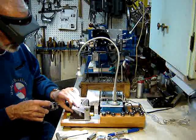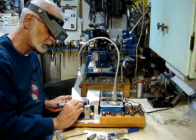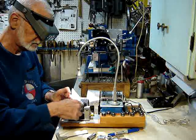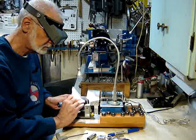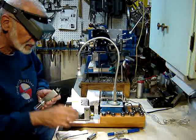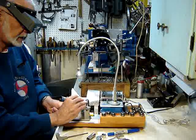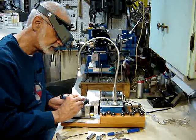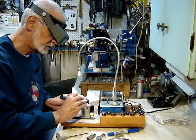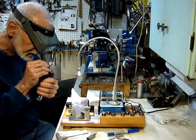Now all we do is push the triangle and let it drop to the primary facet angle. When we don't change the infeed, it will automatically line the facet up. At this stage it needs just a fraction taken off the secondary facet, so we go back briefly. Sometimes it lines up perfectly and sometimes it needs just a tad — and now it's perfect.